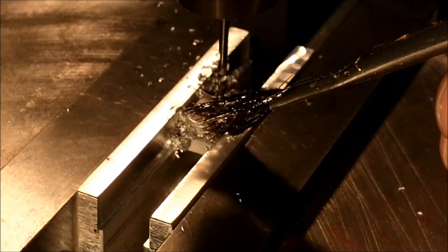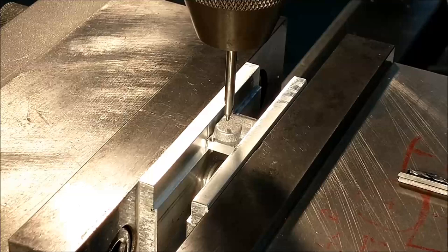Working from the known dimensions on the knee unit that I just finished, I will put in the worm receiver feature in the back of this cap. Then I need to flip the cap over and match this feature on the far side for drilling a counterbore.